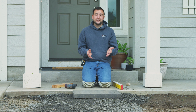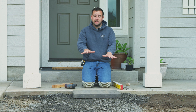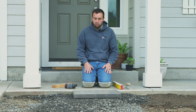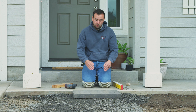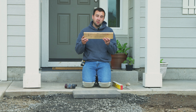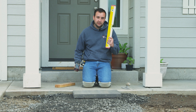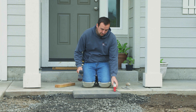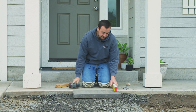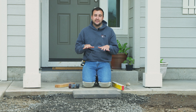We've compacted our gravel base and added an additional inch of gravel as a fluff layer so that we can set our stones in it and give us a little bit of play to make everything nice and flush with our concrete. We're starting here up against the entrance because we wanted it straight with our concrete. We'll make sure we space everything with a two-by-four for both the stones and up against the concrete for the driveway. We're just going to set these flush with the concrete using a level — it doesn't have to be level, just flat. Tap it where it needs to be, and that'll be our reference throughout all these stepping stones to make everything look nice and consistent.